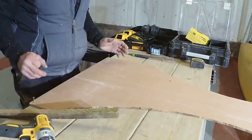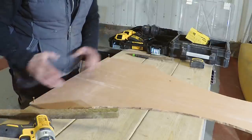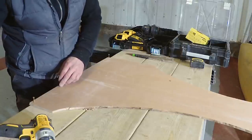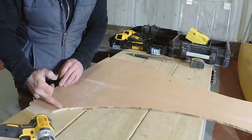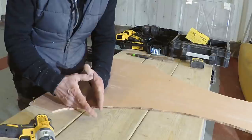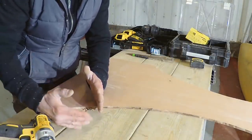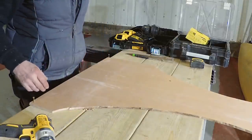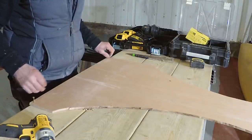Now we've got two of these to do, and we've got a 9-inch pier. So the centre point, if you imagine this being the left hand side and the right hand side there, where these bricks and these bricks meet, obviously there's going to be a centre joint coming up as these cut and gradually come out of that. So the two arches will intersect about here somewhere and have a vertical joint through there, which hopefully should look quite good.